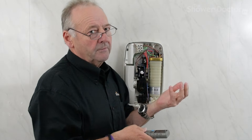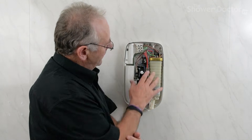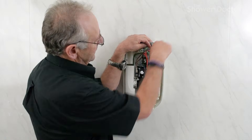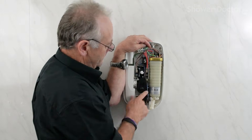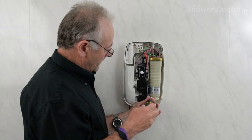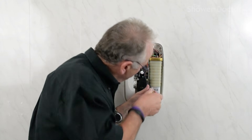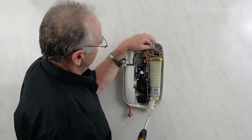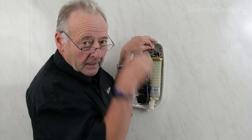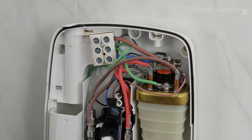In terms of this video, we're going to strip this one out and fit another one. The screws in here are fairly difficult to get into, so first of all we'll slacken off the screws that hold the heating tank — they don't need to come out all the way, just a few turns each. This allows the tank to come forward just enough to get a bit of space to get into the screws on top. Depending on the age, you'll need either a Torx T10 or a Torx T15 bit — it depends on the age of the shower.